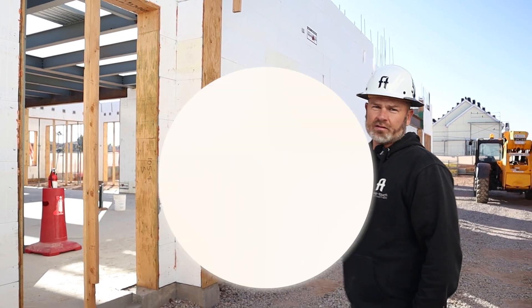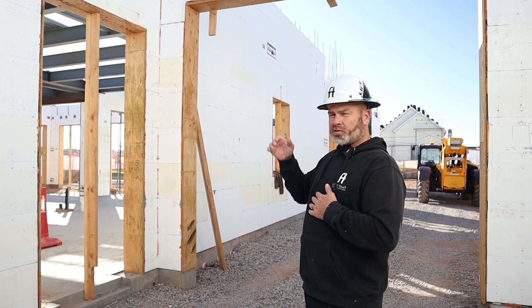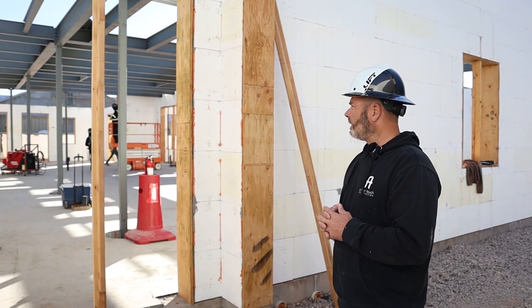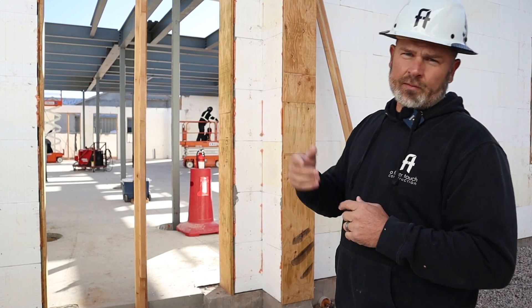Time to sign off here at Liberty Estate. Just a little update — over the next couple of weeks we're going to finish welding the steel pan onto the second floor, make sure all the trades get through the floor with any rough-ins they need, get all our depressions down for the showers and so on. Then we'll come back and pour four inches of lightweight concrete over that to get a nice solid floor. ICF Specialists will come back in and start stacking Fox Blocks again for our second story, and as they do that we'll bring all the rebar down for the second floor windows, dial in all those rough openings, and get us a second floor. Stay tuned.